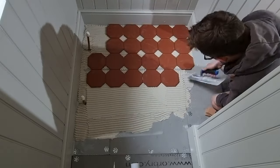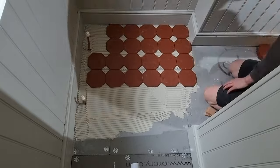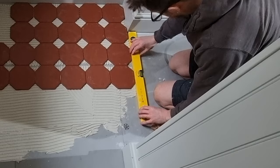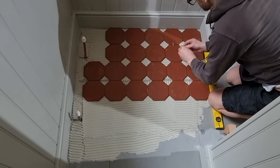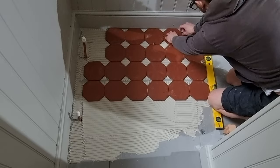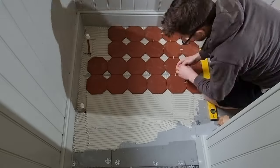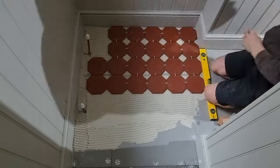This is the other square line I'll be following. I just put my level across there to make sure all the tiles are butted against it, then I can start putting my spacers in making sure everything's nice and neat. Then it'd be time for the tacos. I'm using a two millimeter spacer here - that's always my preferred choice to keep the joint as small as possible.